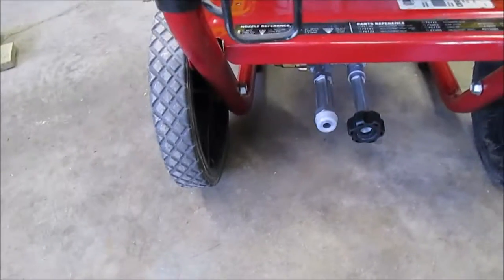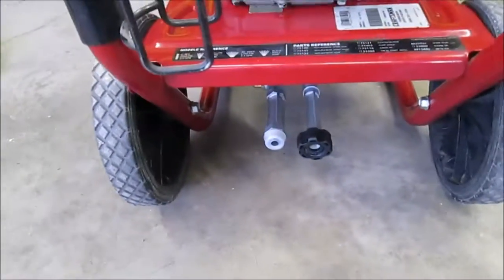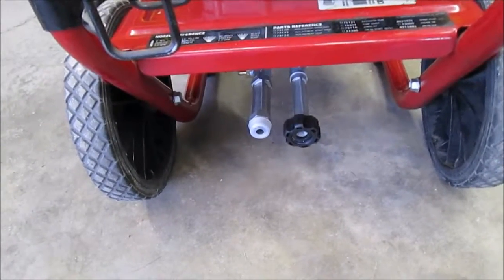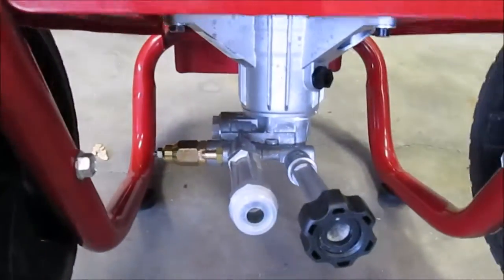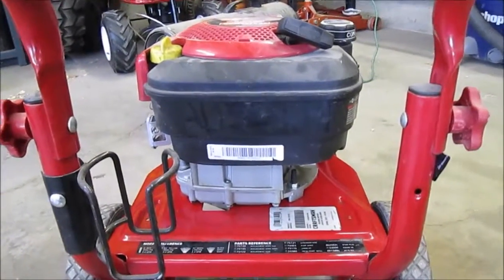The instructions say that every time you use this, you hook up your garden hose and high-pressure hose, hook up your wand, then turn on your water and hold the wand open until all the air comes out. I'm pretty sure these pumps aren't designed to run dry. That's why the last one locked up — I think he turned it on and then went to go turn on his water, and by then his pump seized up. So we're going to see if this motor even runs, because I have no idea.